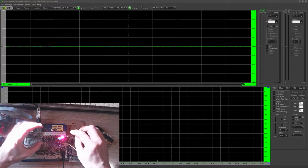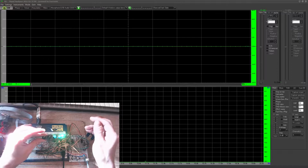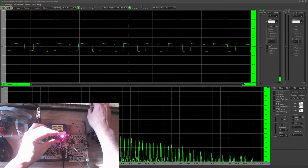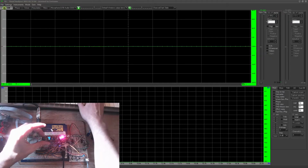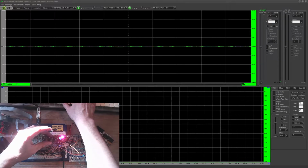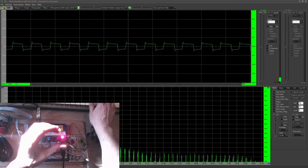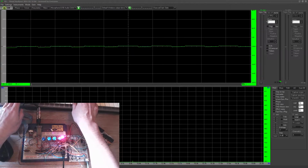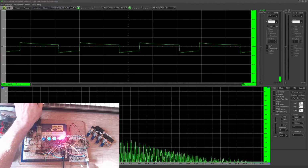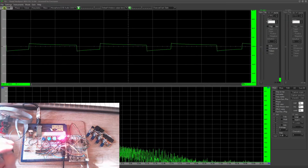While we're at it, this is the filter envelope. Now we go back to the filter and we turn up the envelope, which happens to be that one, and turn down the main cutoff, which happens to be that one. And then we go back to the envelope. That's the sustain level. It's ADSR like usual, and we can do that.